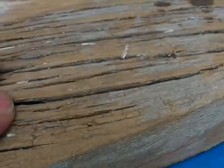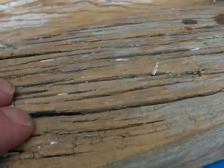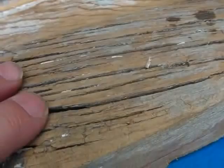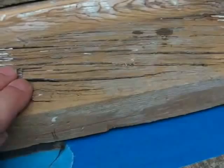Also on this sill, I've left some of the window checks here in this 8-inch section of the sill unfilled, and I'll use some traditional materials, linseed oil and ordinary putty. In this case, using Sarco Type M window glazing putty to fill these weather checks. So this will be another side-by-side comparison field test of wood epoxy repair methods and traditional materials filling windowsill weather checks.